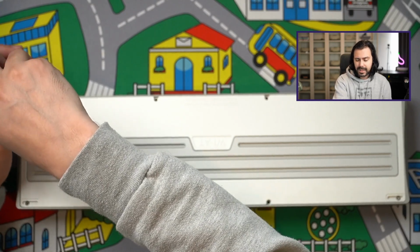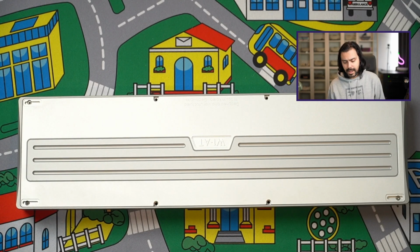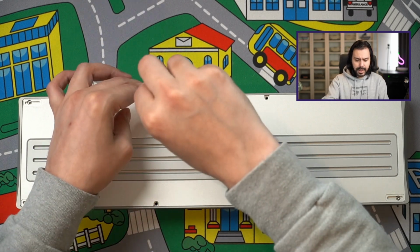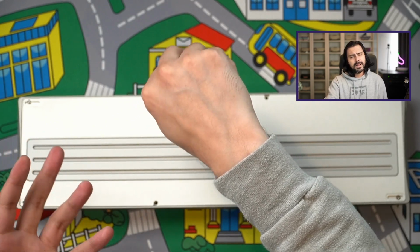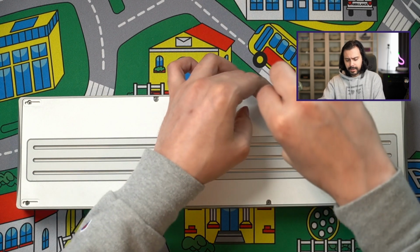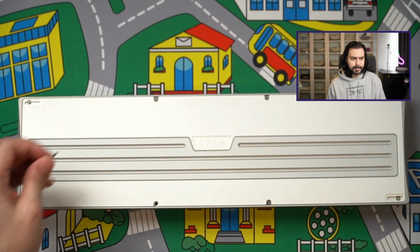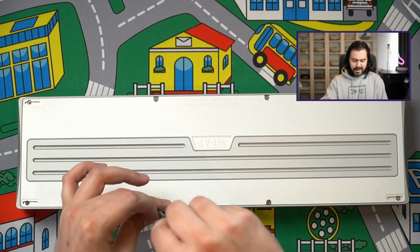You can film your switches, go with a thicker grade of lube, maybe some 205 grade zero, go with thick PBT keycaps instead of ABS, or thin ABS, for example. But the thicker the cap you go with, I don't know how to explain it, the less real of an experience you're going to have in order to feel the flex and all of the nuances of the board. If you put thick caps on it, it's going to be like trying to pick up a screw with a thick rubber glove. You're not going to feel what's going on. So I would recommend not going too wild.